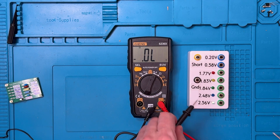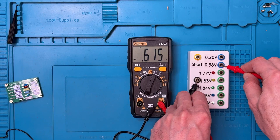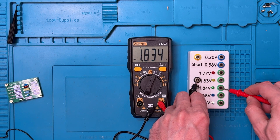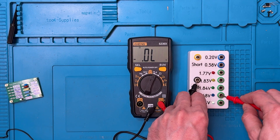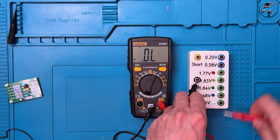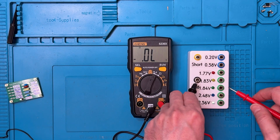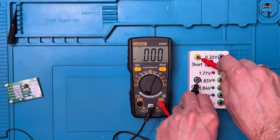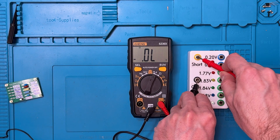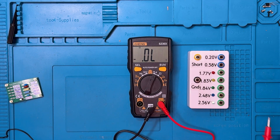Diode check. I have a test box here. Let's see how this behaves. That's a good reading, that's a good reading, that's good and lights up, that's good and lights up. Very dim light on the green. It does not light up the blue and does not light up the clear — the voltage it puts out for the test can't drive those diodes above two volts. For the short, a good reading. There is no tone on the valid diodes, and if you've seen my other reviews you know I like to hear a tone when a valid diode is detected.